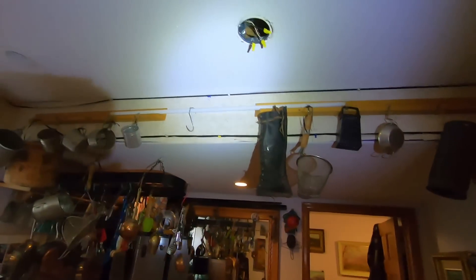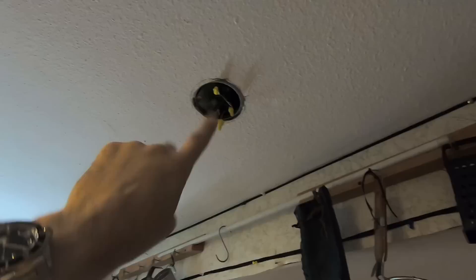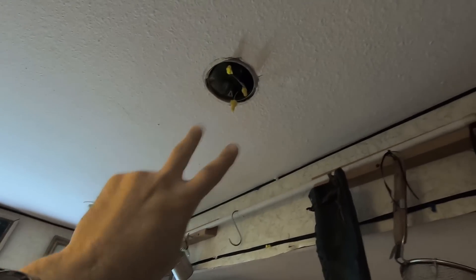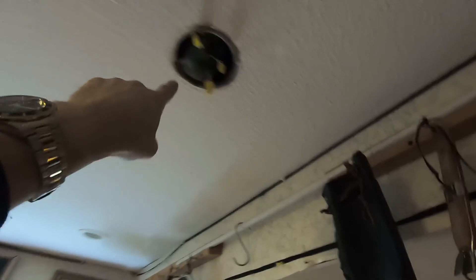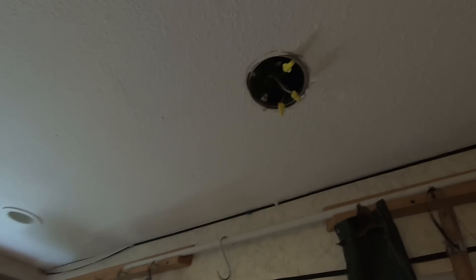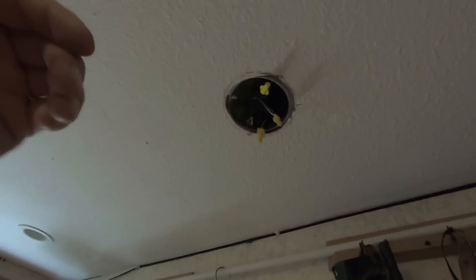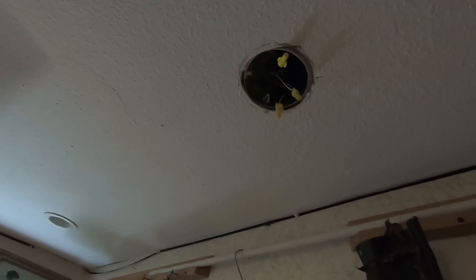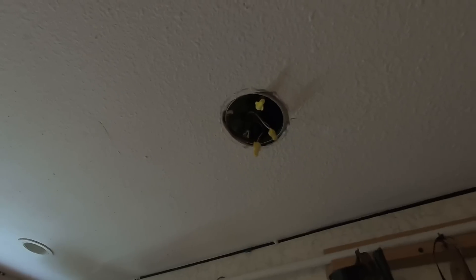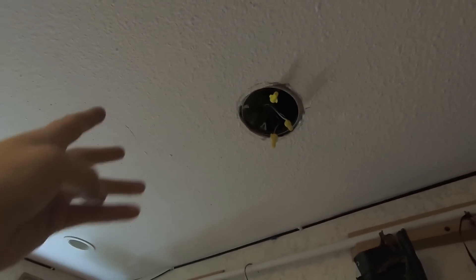The renter tried to put a new light bulb in on top of the broken light socket, and that's what tripped the breaker. So it's been going on for a couple of weeks, and the handyman got it done in about three minutes. Actually, it was the second guy — the homeowner was the first guy, and the second guy took the can parts with him. So I can't put it back together. I told the customer I can dig this thing out, shove it to the side, and wire in a remodel can so he'd have a light today. He said he's going to try to get in touch with the first guy to see if he can bring back the can parts.